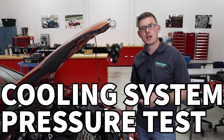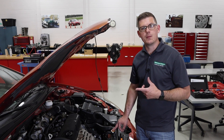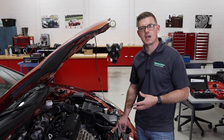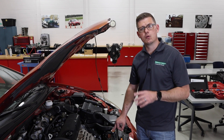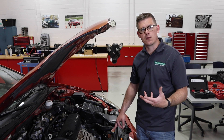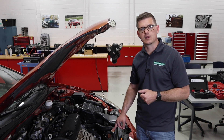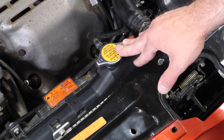In this video we're going to talk about cooling systems and more specifically how to pressure test one. Pressure testing a cooling system allows us to mimic normal operation where most systems operate at about 15 to 16 psi when hot with the engine running. With this tool we can put pressure in the system, check for leaks, verify a repair, and do that on our own time whether the engine is hot or cold. First I want to get the cap off so I can match it up to my test kit.